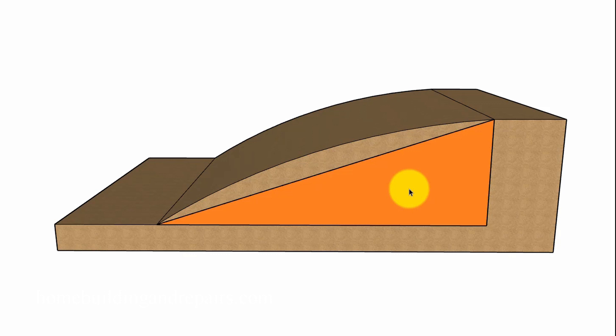I came up with this idea where you can use a string to figure out the angle and then figure out how many steps and how tall the risers are going to be. It's relatively simple, but I do understand that since I figured it out, I'll have a better idea of what's going on than you do. If you have problems with this example, feel free to share them in the comment area. Basically, what we're going to be looking at is figuring out the hypotenuse, or the longest part of a right triangle.